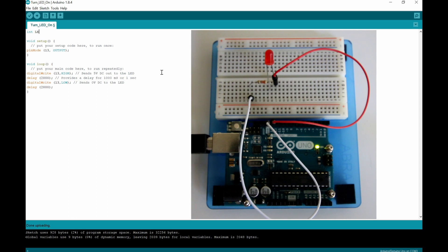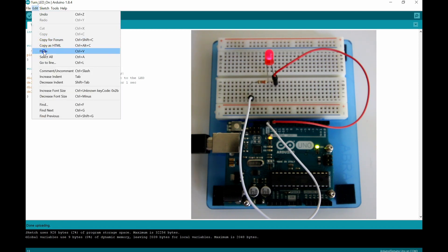So we're going to create some global variables up at the top and make use of an integer — int. The reason we're using an integer is because we have discrete inputs: 0 through 13 as our discrete outputs. It's not like we have pin 2.5 or 5.5. So we're going to say int LED_pin equals 13, and remember to put a semicolon at the end. I'm now saying that my LED pin is equal to 13, and then wherever I had pin 13 I'm going to paste in that variable name.